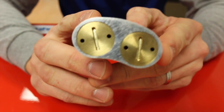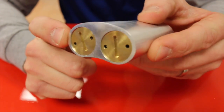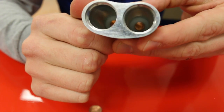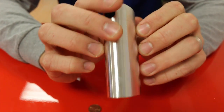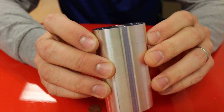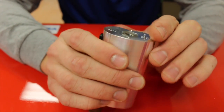In the bottom we have two cylinders for the 18650 batteries, and you can just use any kind of needle-nose pliers or unscrew this with a coin of some kind. Let's go ahead and open these up and I'll show you inside. Inside you have a copper contact for the positive end of the battery, and on the bottom you have a brass contact for the negative side of the battery. And with your batteries running in parallel, this thing lasts forever. If they were in series, where you double the volts, you wouldn't notice much of a difference — it would just be more powerful. But in parallel, you're getting your normal mech mod vaping experience with a low voltage drop and twice the battery life.